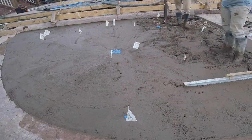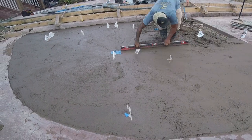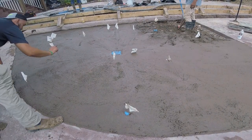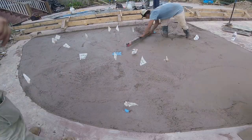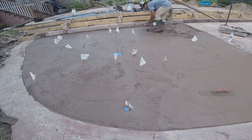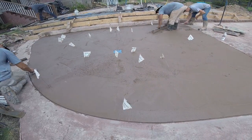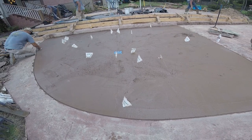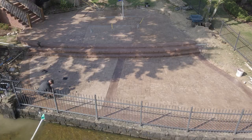After the lights and nozzles are set, we remove the dirt, install the rebar, and tape off all our nozzles and drain with masking tape so concrete doesn't get down inside them during the pour. This concrete mix is the same color we used on our inner patio with our ashlar stamp, and we added microfibers for extra strength. When pouring the concrete, we were able to screed from the center drain outward to the borders, which created a bowl-like surface that funnels the water down into the drain.